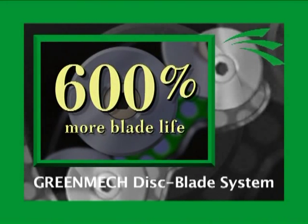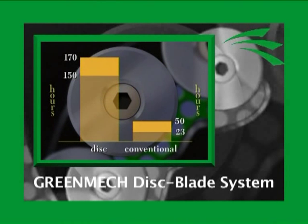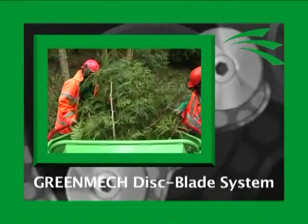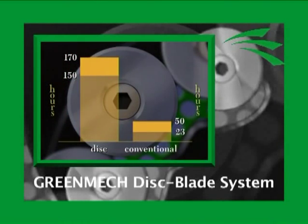In simple terms, you'll get up to 600% more blade life. One operator kept records of his disc blade performance that shows that the blades were not resharpened until they'd completed 150 to 170 hours of work. He calculates their life expectancy should be in excess of a staggering 1200 hours. By comparison, he found that the conventional blades needed sharpening every 23 to 50 hours and replacing at about 200 hours if not damaged earlier.